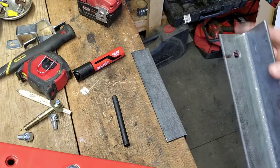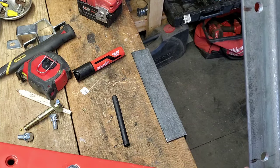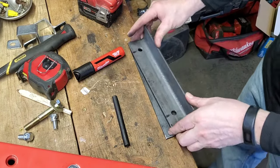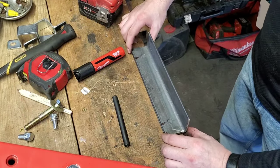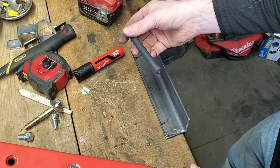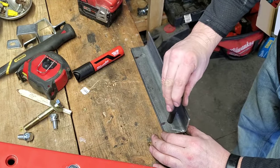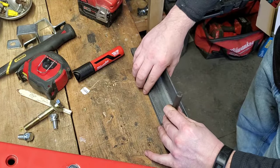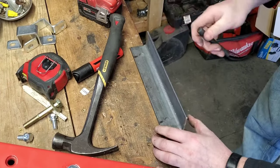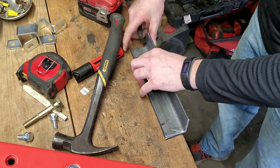Here's how I'm going to mirror my holes from one piece of angle to the other. I've got my one that I've already drilled, I'm going to take it, set it on top of this piece of angle sitting on the corner of my workbench. Get our edges lined up, take my half inch centering punch, go into the half inch hole I have there, set that in there gently, make sure I'm all lined up, take my hammer, and give myself a nice dimple there. Now we'll go ahead and do the other side.